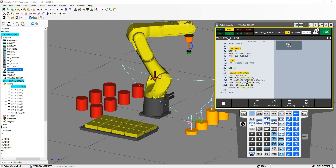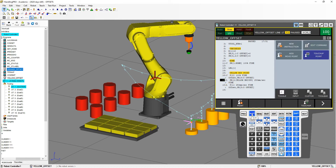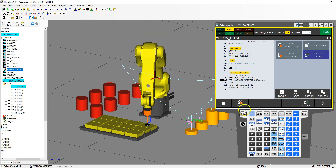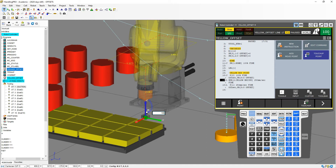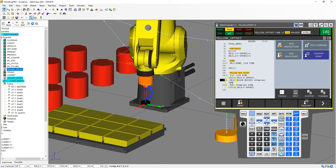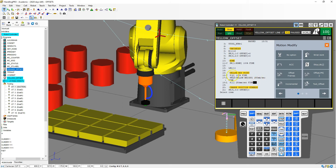So it's moving back here. The reason why is because we have this position register offset. Let's actually turn this off. We'll go choice on here and then no option. Now let's go back and go shift forward, and it should go down to our position right here. So now with the offsets off, we can actually save these points. Now let's move this up so that it is 100 millimeters above.